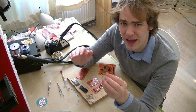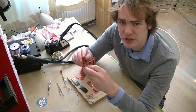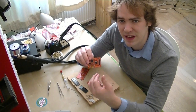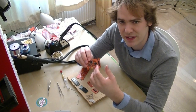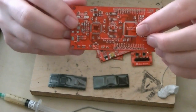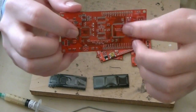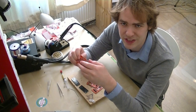Version 2 and 2.5 have supported just about every sort of JTAG debugger out there — we've got an image for JTAG key, an image for KT link. But recently there's a new JTAG protocol that only uses two or three wires for debug, which is a big improvement over the old protocol that used up to 10. With the new protocol, we actually need that secondary JTAG link to do some extra functions. The problem is on version 2, that's connected up to the CPLD for programming. So to get around that, we came out with version 4, which adds a 100-pin CPLD and some circuitry to switch those pins on and off. In one mode the FT2232 can program the CPLD, and when we flip the jumper, those pins can be used as part of the JTAG debugging circuit — meaning we can support the full features of the new reduced-wire JTAG debugging protocol.